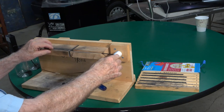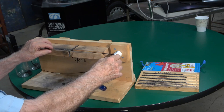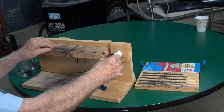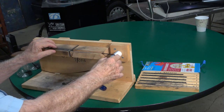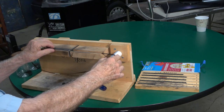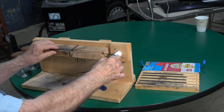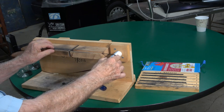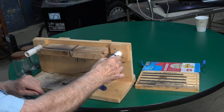If it won't fit in, your band obviously is too short. One of the possibilities is they're not clean enough, but if you've done an excellent job on cleaning them, the last one should fit in nice and smooth. That's why there's a split hub on the winding fixture that you can adjust and compensate for however your band comes out. It may take you several iterations to get a decent band. It took me two, by the way. The first one, I couldn't fit the last slug in. So, and that's how you do it.